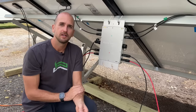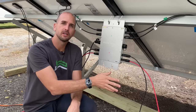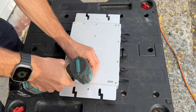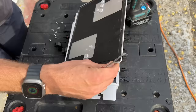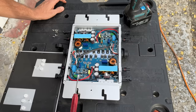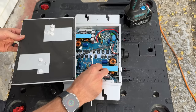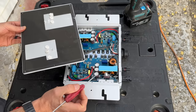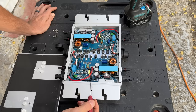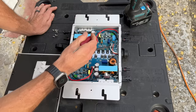To finish off the video, I'm going to take this unit apart — unplug everything, take off the top cover, and see if we can find any heat damage which would be the source of our failure. From a visual inspection, we're confirming this is just two 600-watt units together in one housing, connected through a set of conductors. I don't see anything that stands out as visibly fried. There are small pads on the caps that pad up to the aluminum housing, which helps conduct heat from the capacitors to the case. But based on the Amazon reviews and the failure on day two at only 45°F outside, this unit clearly has an issue dissipating heat and causing failures.